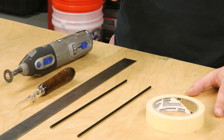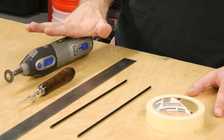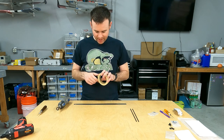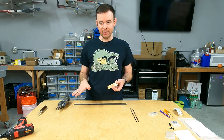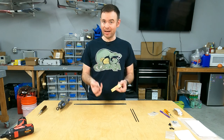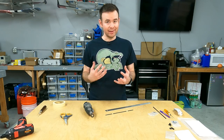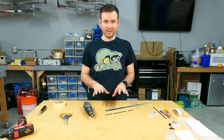To actually cut the carbon, we're going to use a rotary power tool such as a Dremel, or we can use a small hand saw — the rotary tool makes it a lot easier. We start by cutting a piece of masking tape to wrap around the tube at the cut point. The reason we use masking tape is to contain any splinters that might come off the tube during cutting and to make the process a lot less risky to the integrity of the tube. With the power tool, we'll cut through the center of each piece of tape. Whenever you're cutting carbon, be very careful about dust and particles — you do not want to inhale or ingest that stuff.